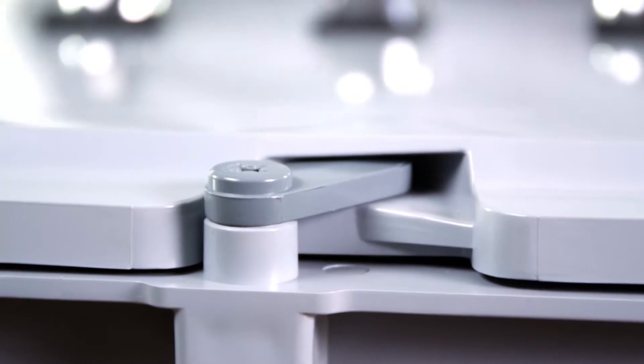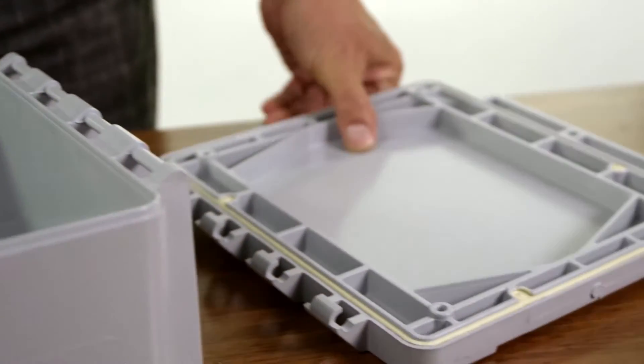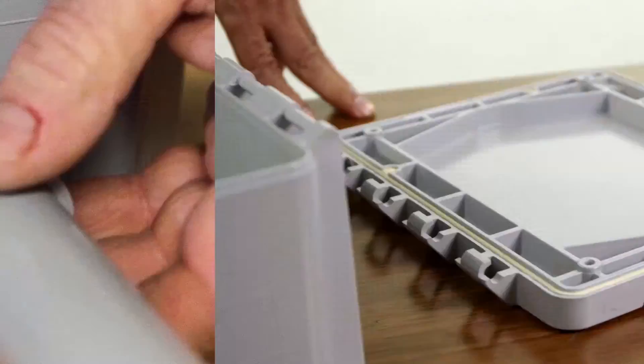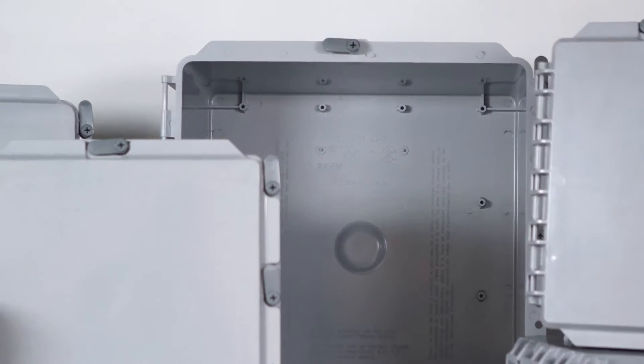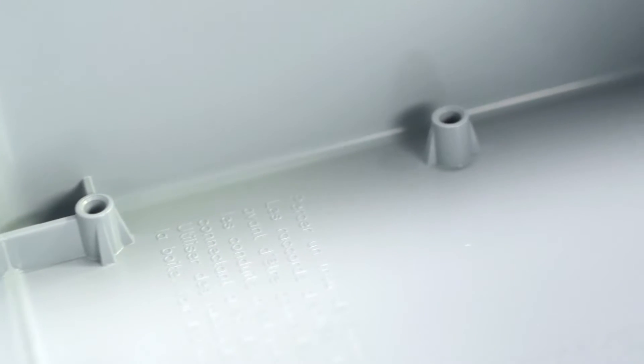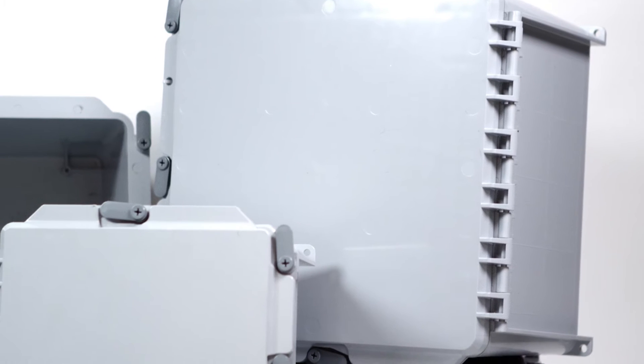Features like non-metallic hand-close fastener tabs, molded mounting feet for quick installation, lockout option for added security, a smooth inside flat cover to easily mount devices, grid lines for drilling conduit entry, leak-free gasket, mounting boxes for DIN rail and back panels, NEMA 3R and 4X rated, and UL listed and CSA certified.